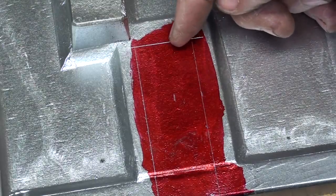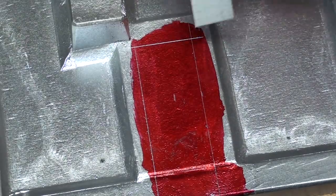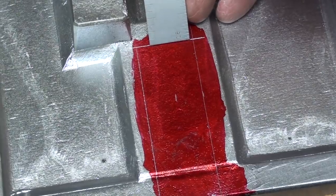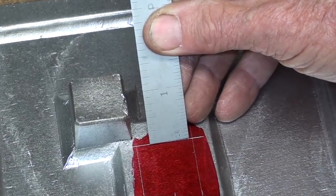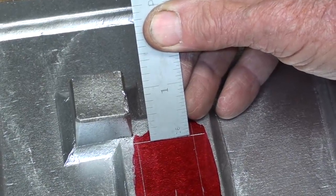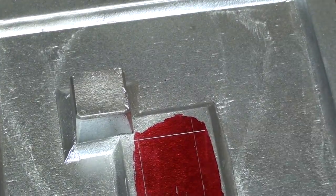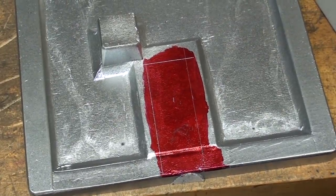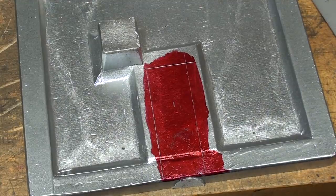There should be a 45 degree angle. Probably won't make sense to you at the back end here. In other words, it should slope at 45, something like that, so that the table can be tilted, and that only the leading edge on the other side comes close to the belt. And these tables were very subject to damage by the belt when the belt would shift from one side to the other, which it often did. So these machines self-destructed. I already showed you some of the parts that are partially ruined because of that.